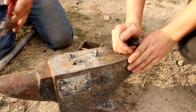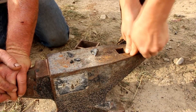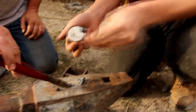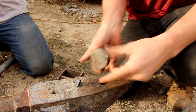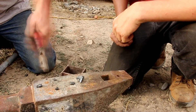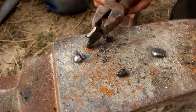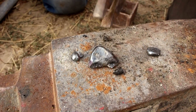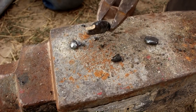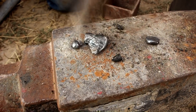Hey Cody, what just happened there? The magnet stuck to the anvil. Let's see if any of these cooled off. It's iron. Made iron from a rock. So it breaks — that's about like cast iron. So it wouldn't make a very good knife, would it? Not until you worked it a little bit. I guess you could blow oxygen through it like the Bessemer steel process and make it into steel, because right now it's just iron.